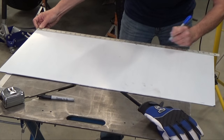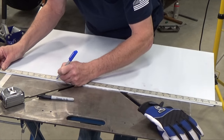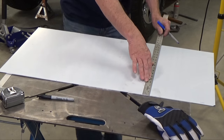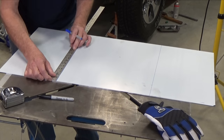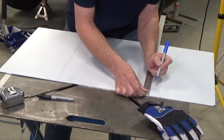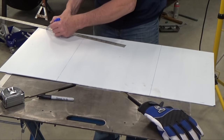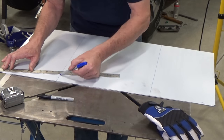On all your 35-inch pieces, mark 10 inches in from each end, and then mark 2 inches in from each side of the 10-inch line — this should give you 15 inches between them. Connect the marks on the 15-inch line to the outside edge of the 19-inch side. These are your cut lines and make up two sides and the top.